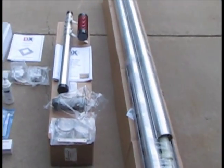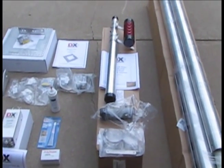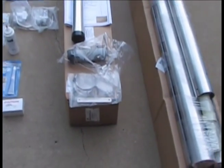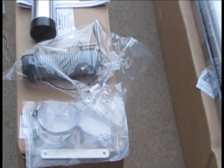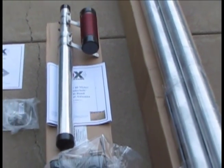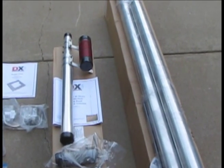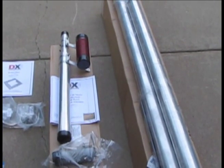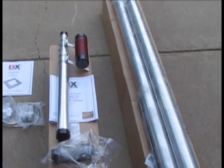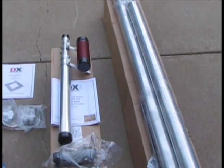In the shorter box, there was the loading coil and the trap — the loading coil at the base and the appropriate hardware for it. The trap is quite substantial and sits midway up the antenna; it's a tubular capacitor and a coil inductor that are tunable.